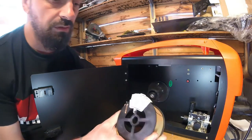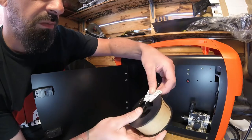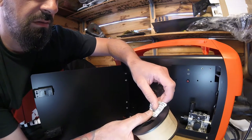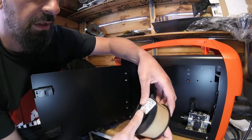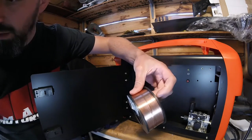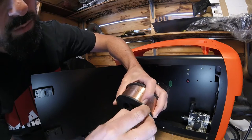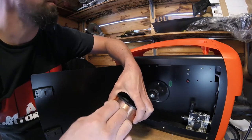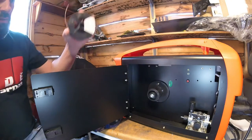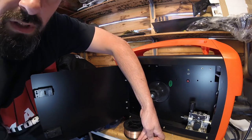I've got the 0.8mm wire roll — it's a 1kg spool, net weight 0.7kg. I'm going to remove the sticker so it's not flapping around, then peel off the ground tape. Once I can see the start of the wire, I'll grab my snips, snip that end off cleanly, and we've got a nice straight end ready to feed through.